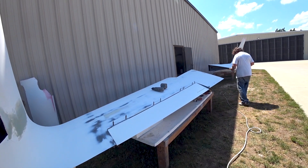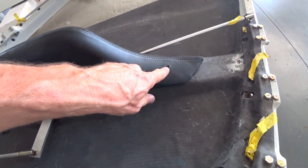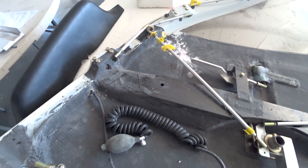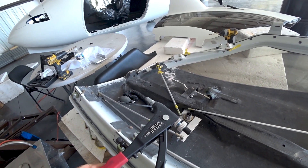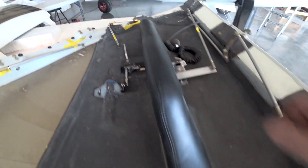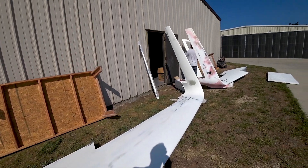Just got this other aileron cleco'd into place, so the next step is to work on getting the rudders sorted out. Now I'm moving on to drilling the holes and putting in some rivnuts that hold the armrests onto the door frames. The actual panel that covers the door covers where these bolts are, so you drill right through the vinyl. Got those in on both doors, so now I can put the doors back on the aircraft and make sure all the locks are working correctly.